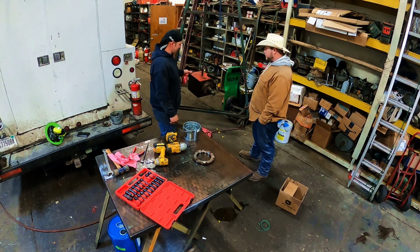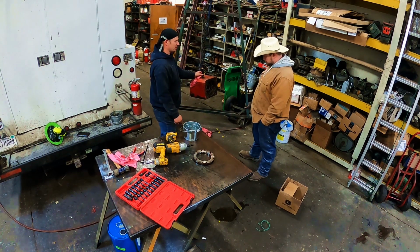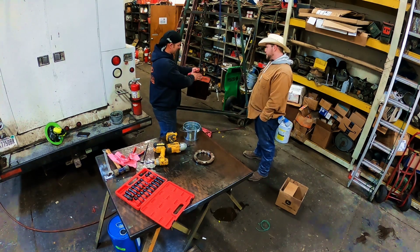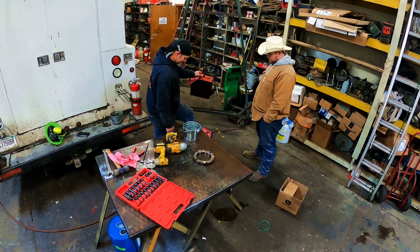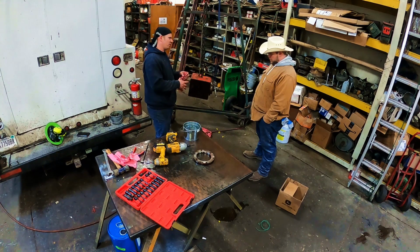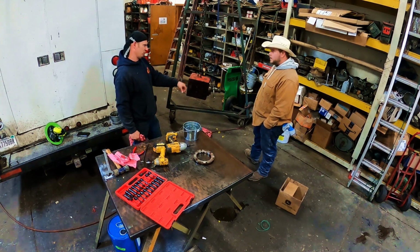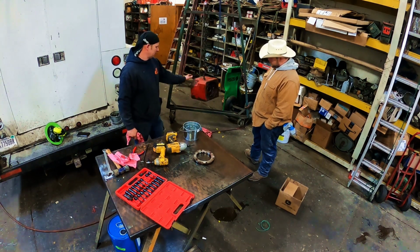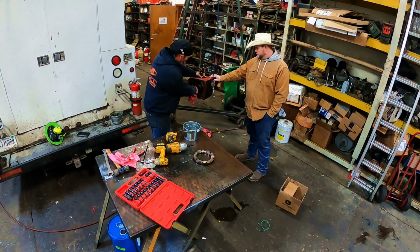Well, to carry the weight, it's got this bearing carrier. Inside that's two ball bearings, three big ball bearings. So it takes up the strain of the saw. But what drives it is this motor. It's a hydraulic motor. So this carrier's waiting on that drive. All of it's old, wore out. Yeah. The seals went out of that because the bearings are too floppy. And then got the leaking oil in here. Still had oil. And the shaft's all worn out where it's loose.